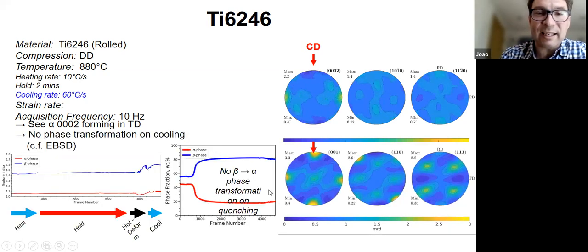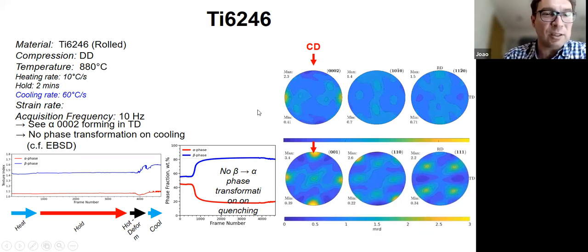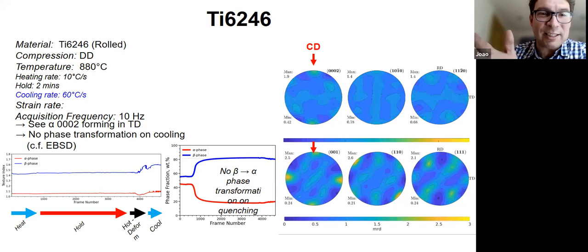And what's exciting about this one is that in 6246, we quenched afterwards and we can do EBSD. So we'll tell you what we see in the EBSD and how it matches with what we see in the synchrotron. So here we go. We caught it happening in real time, this transition from the C-axis going from the compression direction to the TD